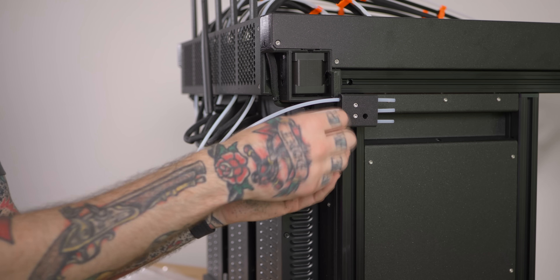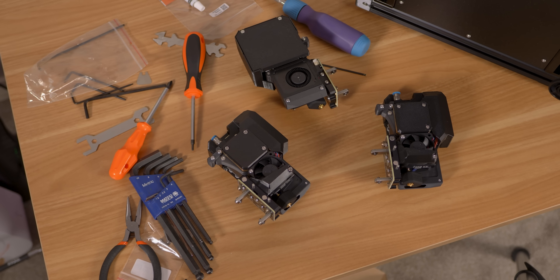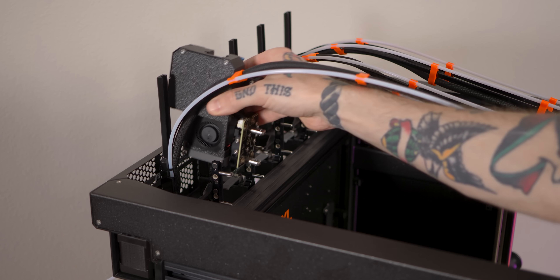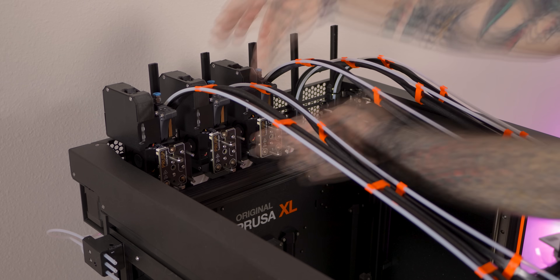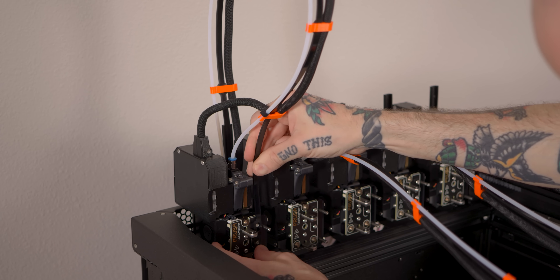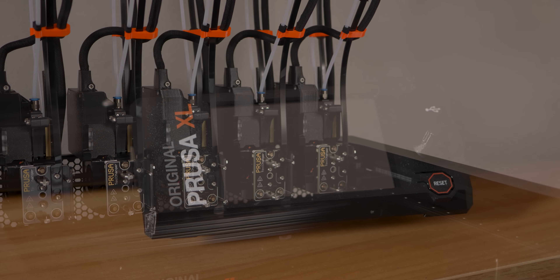There are also filament sensors in each tool head, and five spool holders to install that can be extended for larger spools. The last step is installing the tool heads into the machine — I just thought they would look cool, so I wanted to admire them for a moment. You manually install them for the first installation, guiding the rods that locate them, and they attach via magnets onto their docks. Each of them needs their wiring harness attached with its own strain relief, the reverse Bowden tube, and a dedicated strain relief per tool head. Repeat that four more times and you've got all the tool heads on and you're ready to power it on.